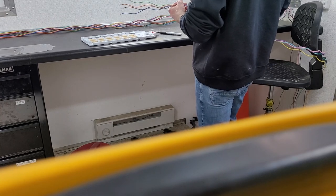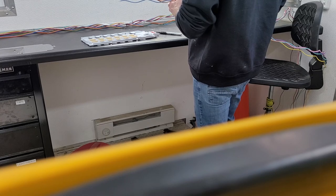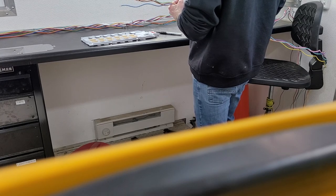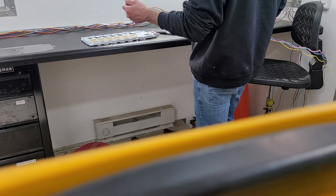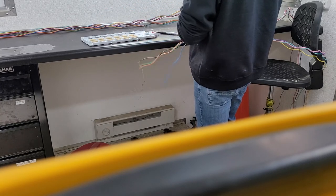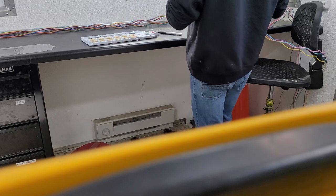There's a color code order for fiber. It's blue, orange, green, brown, slate, white, red, black, yellow, violet, rose, aqua. And that just repeats over and over in most cases. There are some other colors in maybe one or two other cables, and sometimes you have a stripe.